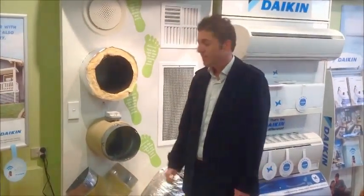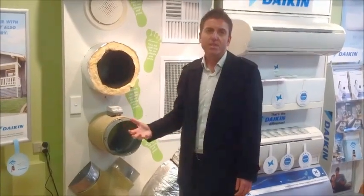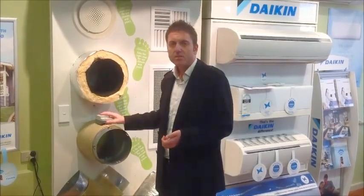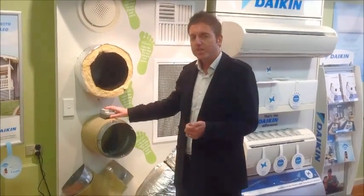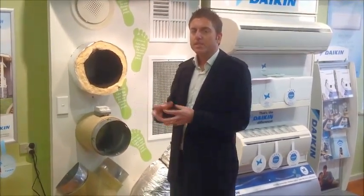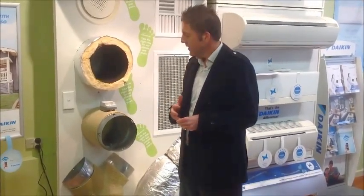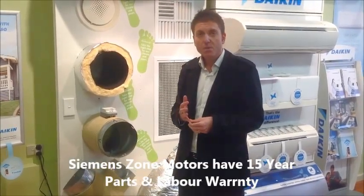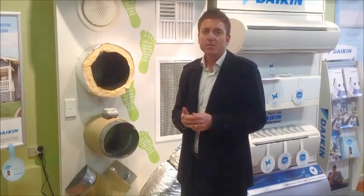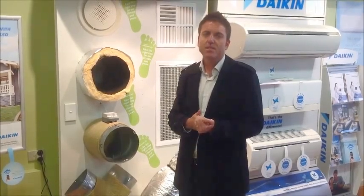Just in relation to the warranty on the zone motors, it's really important to know what the warranty is — how long it is and what it covers. Does it cover replacement? Does it cover replacement and labour? This particular brand, the Siemens brand, is very heavy-duty and is really only operating to perform the open or closed function, which drastically increases the lifespan of that motor. Because of that, there is a 15-year replacement warranty that also covers the labour for 15 years. That's why we insist on using this particular motor — it's peace of mind for you as the consumer, knowing that if anything were to go wrong, we'd have it replaced under warranty for 15 years.